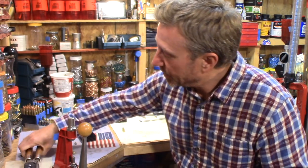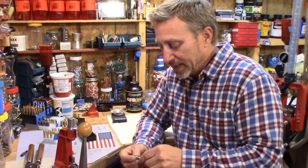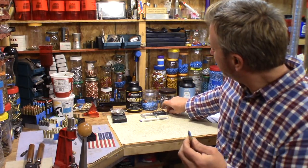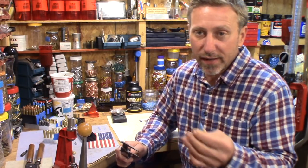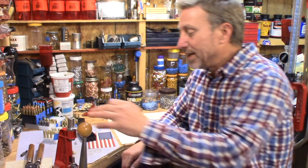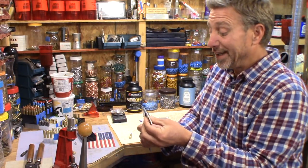the bullet itself is designed for 7.62 by 39 and the 300 blackout. This was one of the Elvis creations that Arsenal helped me out with. One of the things I noticed, obviously, is that in the AK this thing shot wonderfully. I had plenty of large freebore to go around for sizing this thing to 310 or 311 or whatever I wanted. In this one, my 309 sizer tends to size these bullets to 308.